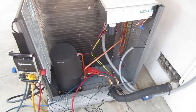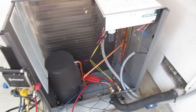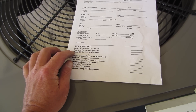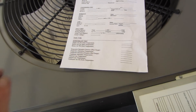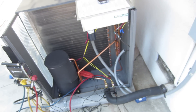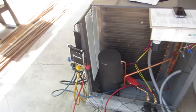I have to go inside and get the return air. What I've got to get here is the supply air dry bulb, return air dry bulb, and return air wet bulb. I've got to get all these measurements, going from the condenser to the inside of the unit. It has to be done in a timely manner, so I can't wait until they come out with the wireless probes.